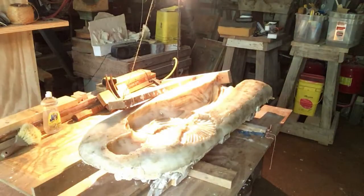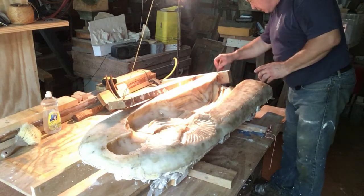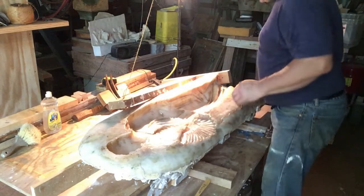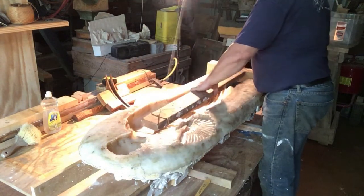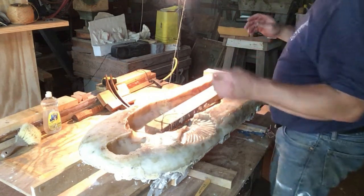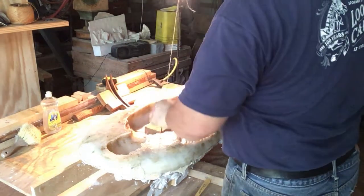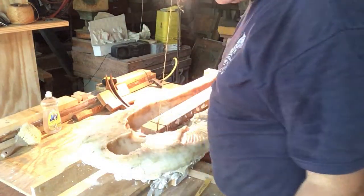That's all released now. You don't really have to release this — it'll let go on its own. But this is one more chance to make sure that the silicone mold is pushed completely into the mother. There was one spot where it was a little high and you can work it out. I made a quick armature — just sits in there — to support it in the rubber so it's somewhat centered. Just cut a dovetail on the bottom. This will help take some of the strain off of the actual plaster, because the plaster isn't that strong.